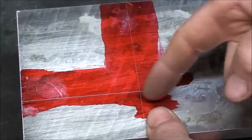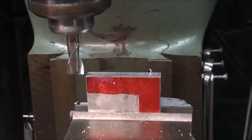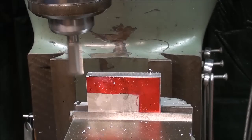I'm avoiding the corroded end. I've already done some milling and squared this up on two ends. I put layout dye on there and marked it three inches by three inches with a combination square, then went to the bandsaw and sawed it out — only took 90 seconds. I discovered that putting a little kerosene on the bandsaw blade with a brush keeps the teeth from loading up. Now I'll mill right down to my line with it mounted in the vise and do both rough-sawn sides.